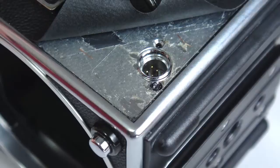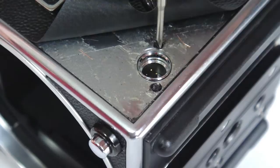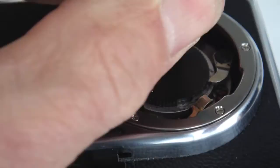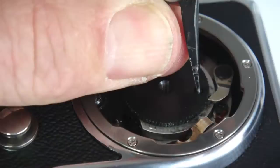The condition of these screws is poor — they probably should be replaced, but for this video we will go ahead and install them. If you inadvertently release the shutter while slipping the mechanism back into the box, the shutter can be re-cocked with a pair of needle nose pliers or with a spanner wrench.